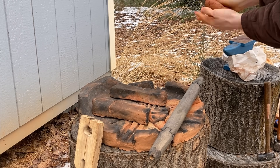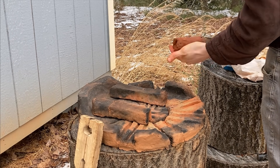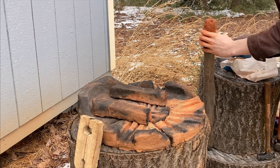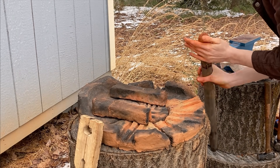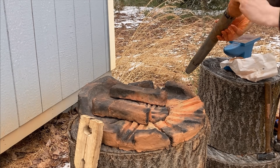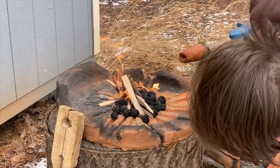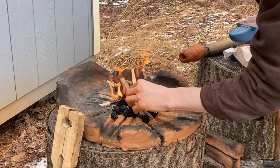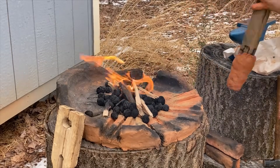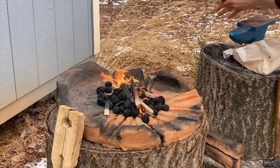Now I can finally say I have everything I need to activate the ancient forge. I'd very much like to start casting bronze and smithing metal right away. Unfortunately, while I have the requisite materials to power the forge up, I don't necessarily have the knowledge or skills to actually use it properly. I start by applying the wet clay tuyere to the end of my blowpipe. I built a small wood fire in the center of the forge and placed some charcoal around it. The way that wood disintegrates into a flame as it burns makes it easier to light than charcoal, which has a much more subtle flame with the burn happening at the surface of the fuel. Once the fire is going nicely, blowing on it will light the nearest coals, and with that the forge is lit — from this point, it's only charcoal.